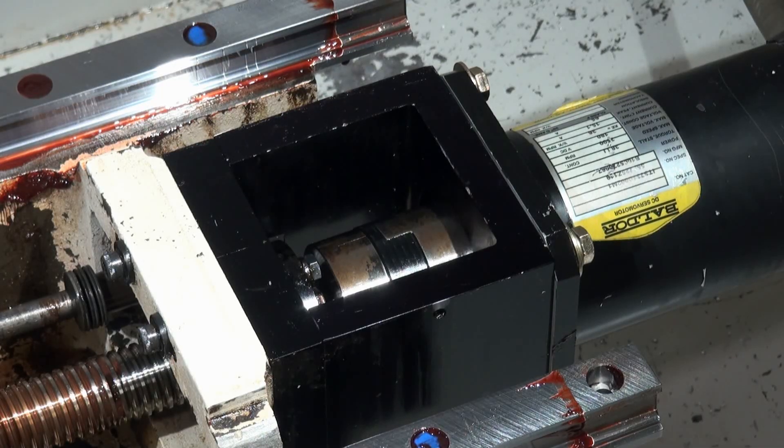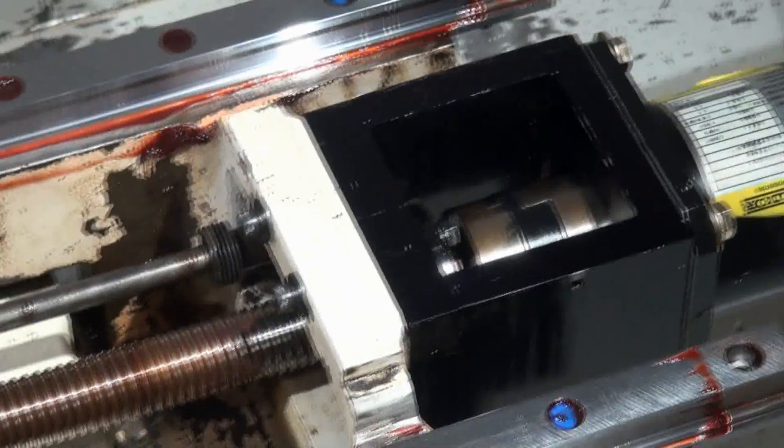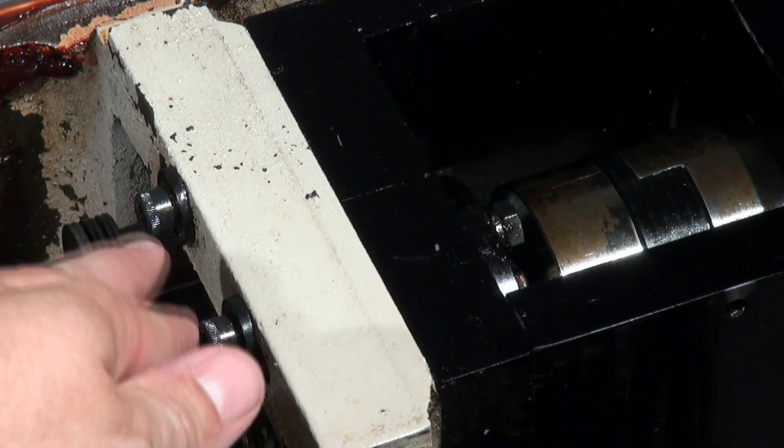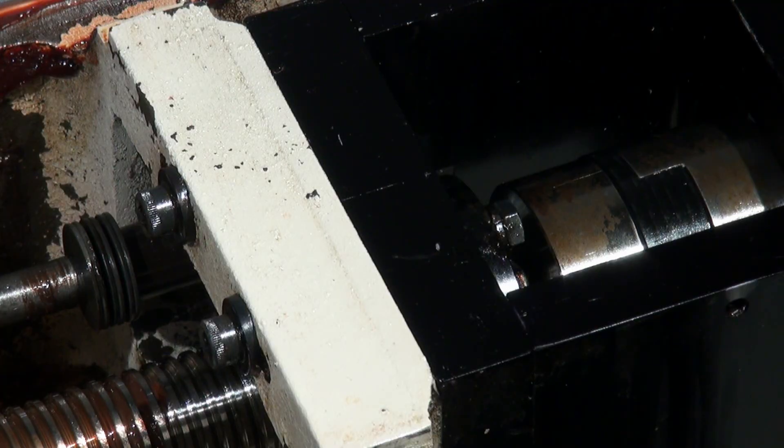Those are the three main sources of backlash. We can measure all three sources pretty easily, and we can also measure to make sure our ball screw is running true and isn't getting twisted, torqued, or canted. If you find your ball screw is not running true, there is an adjustment system — you can move the motor connection around on the Fadals to true up your ball screw. It's important that it runs true for consistent ball screw pitch through the travel. With a simple test indicator and indicator holder, we can quickly diagnose any ball screw backlash issues and identify where they are to make the appropriate repairs the first time.